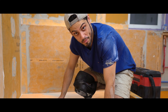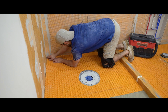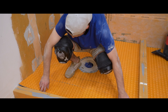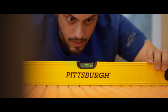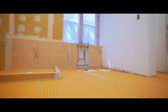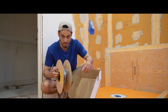Just the shower pan and then we're done with the DITRA part. We actually debated a little bit if it was worth putting heated floors into the shower, but why not? As long as everything drains, I'm happy. As long as I get everything adhered down well, everything should still be sloped towards the drain. And we're done — check for level and flatness. I have a feeling running the wiring is going to be a pain, and we're not going to get it on the first try. We'll see.